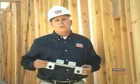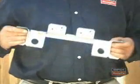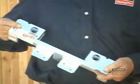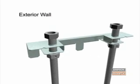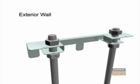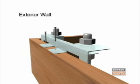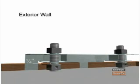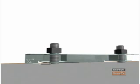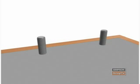The standard template, or SSWT, has the benefit of being reversible and may be used for both interior and exterior wall applications. Start the installation by securing the anchor bolts to the template. The next step is to place the whole assembly on the wood form. Be sure to check that it is in the right location. The third step is to pour the concrete to the top of the compression nut. After the concrete is cured, remove the nails, the nuts, and the reusable template.